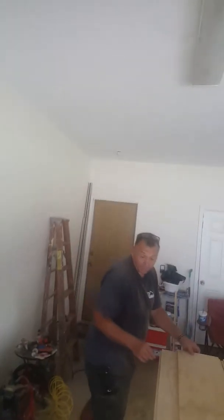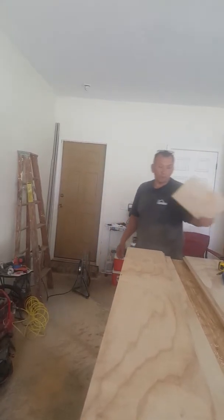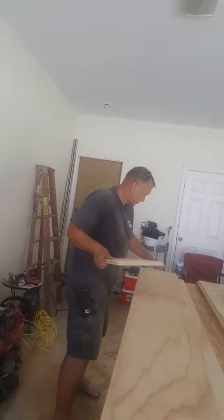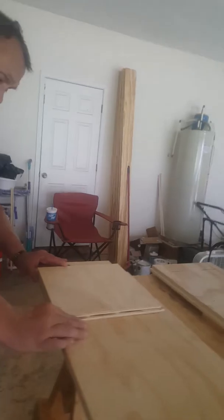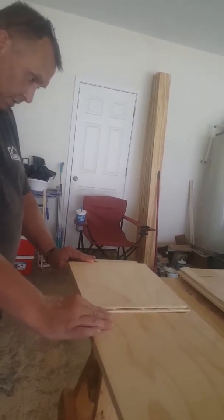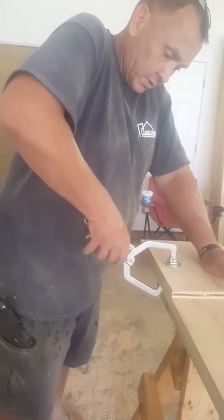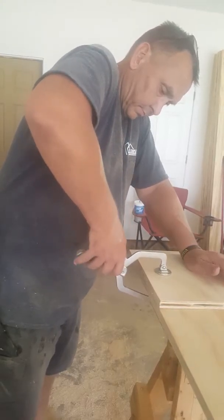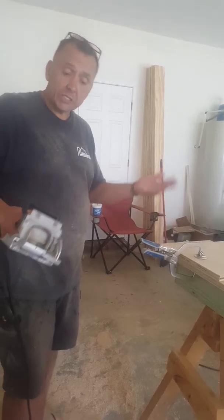So the first thing I like to do is go ahead and get my biscuits out of the way. I've already got my marks there. These are the cut-offs actually from these when I've got my heights on the cabinets, so I usually just use this as a guide. You've got a nice three-quarter nominal side to put your biscuit up against, and I'll just line it up with my marks. I'm using the Kreg Quick Clamps. The biscuit has already been set - this is 11/16ths plywood, so I went with 3/8ths, which is just half of 11/16ths.